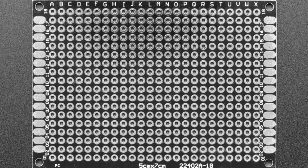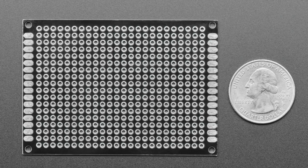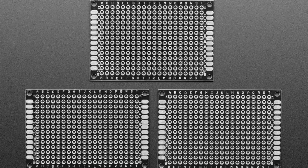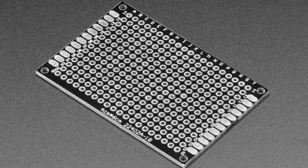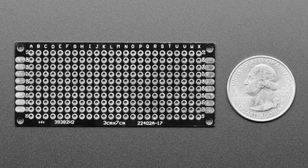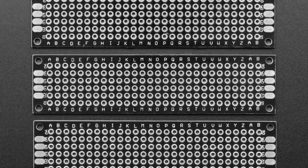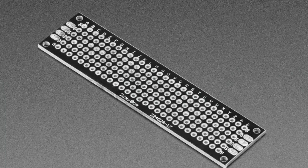Next up is a bunch of different products — basically one product in different sizes. Some folks were emailing us asking if we could carry just everyday perf board. This generic perf board doesn't have any wires between the pads, but it has a big grid of 0.1-inch plated through-holes, double-sided on FR4. We also have perf board made with phenolic paper, which is less expensive and easier to cut. The FR4 version is harder to cut since it's fiberglass, but it's strong. You used to be able to get these at Radio Shack, but that doesn't really exist anymore. We have three different sizes: long and skinny, a medium rectangle, and a really wide rectangle.